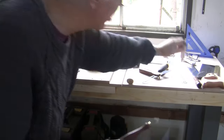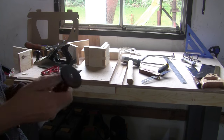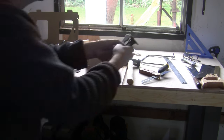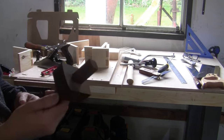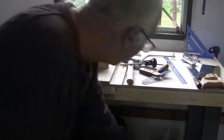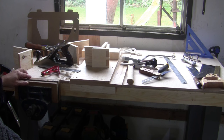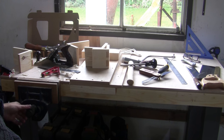I've bought one of these dovetail marker types - I'll show very quickly me making the drawer thing. Sometimes I prefer using that type of marker, sometimes a really sharp knife. The one I don't like - and I don't even know where it is because it turned out to be a complete disaster - is the one with the little pin that sticks out. If you pull it along the wood it just rips all the grain out. Anyway, the vise is fantastic. I've been using it for this stuff and I don't know how I did anything without it. It's paid for itself already.